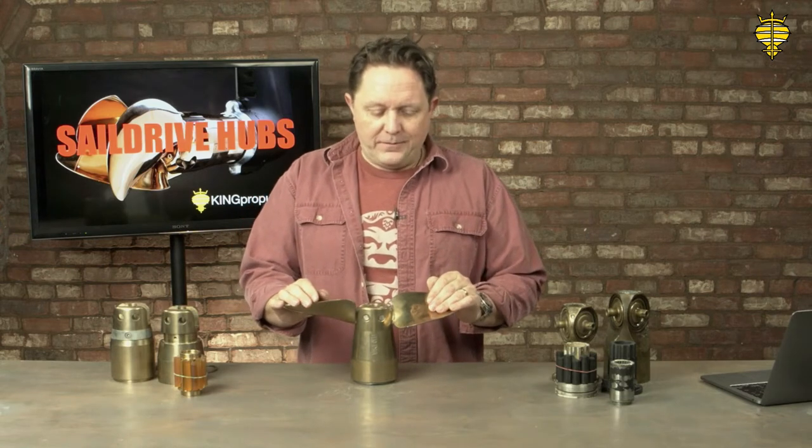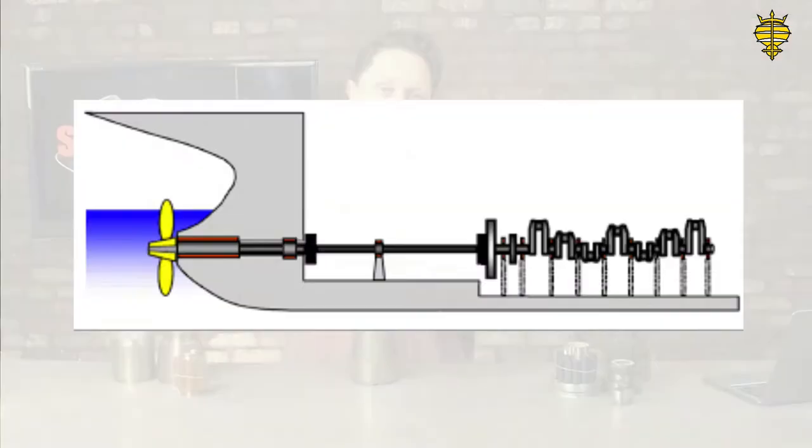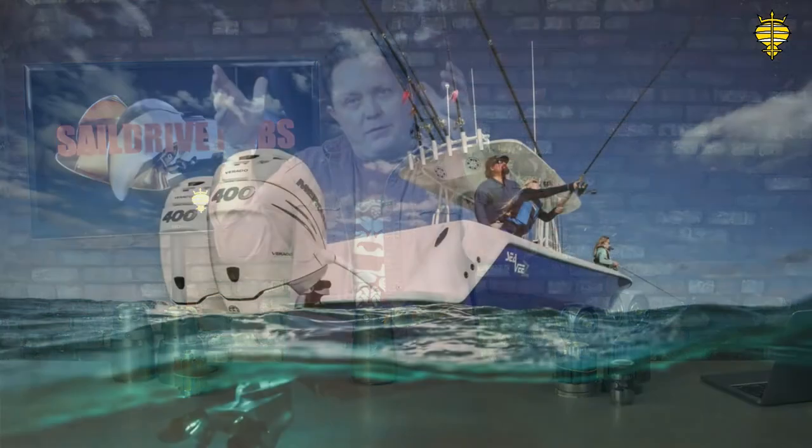The purpose of the sail drive hub, very simply, is to remove the shaft line. If you think about a traditional engine — it comes up from the engine through the transmission, a long propeller shaft through a stuffing box and then to the propeller. That's worked well for centuries. With modern materials you can start to play with things, and if you think about an outboard, the engine above comes down through a shaft through a bevel box and out to the propeller — it's a similar kind of system.